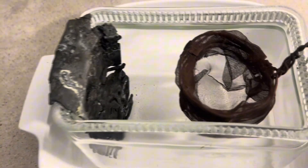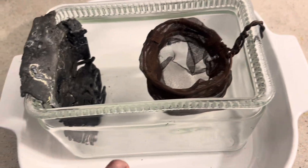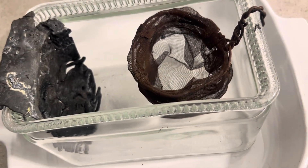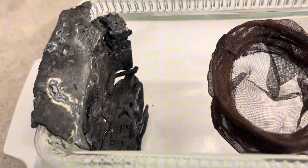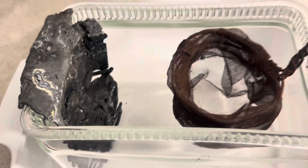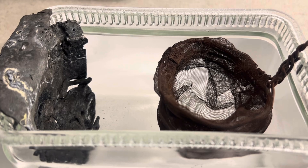Good morning YouTubers, refiners, scrappers, and enthusiasts of e-waste recycling. Today I'm mocking up my sulfuric acid stripping. We're going after some stuff like that and some pins. This is an old lead cathode I had used previously — it still has some gold on it. I'll probably have to use that when I smelt and cupel the gold. We'll put sulfuric acid in and hook up our electrodes and start running this very shortly.